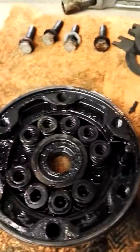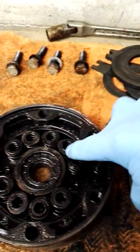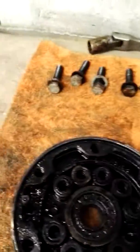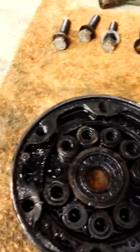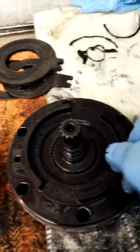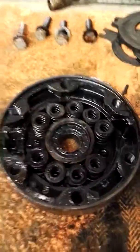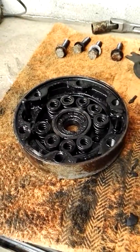This big plate is quite thick — about a quarter of an inch. Underneath that are springs, and now you can see that seal a bit better — it's horrible. These springs are also horrible. The heat's got to them, old age has got to them. Some are high and still quite good, some are low and not good at all. So we need new springs. Clean it all out, put in the new seals, put in the new springs, put it all back together in the right order. Don't forget to put the new seals on here — everything spotlessly clean. Do a damn good job and you've saved a lot of money.